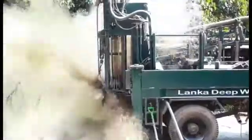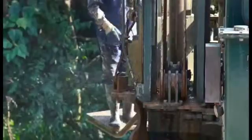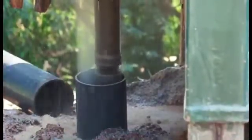After reaching the required depth, the well should be flushed properly by compressed air. The flushing process may take up to 3 hours. After getting clean water from the well, the flushing yield will be measured by using a V-notch.